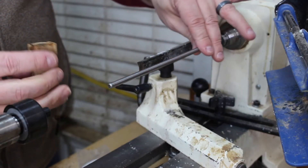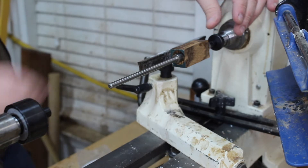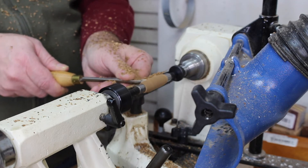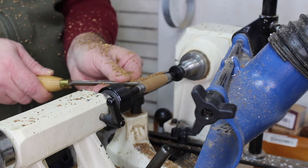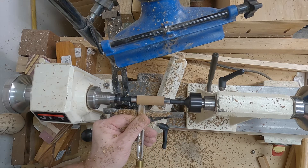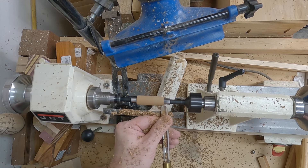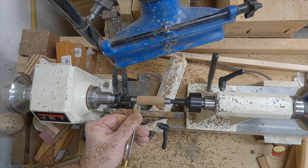In the next few clips you'll see me turning a blank for a bolt-action pen. This pen is very easy to make — probably one of the easiest pens to make out there. It's a one barrel pen and the bushings on both sides are equal diameter, so you don't have to worry about getting the bushing sizes mixed up or mounted wrong on the mandrel. I like to turn mine with a slightly curved profile, though some like to make it more of a flat profile — it's really up to you. I usually finish my pens with a friction polish and I'll put on three coats. I've had great results from this friction polish called Pens Plus and it holds up very well over time.